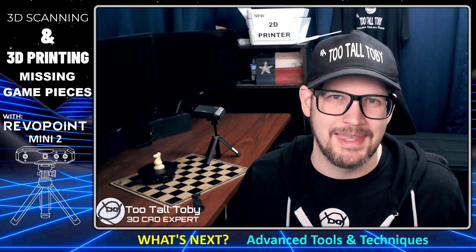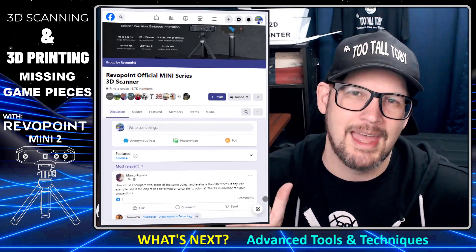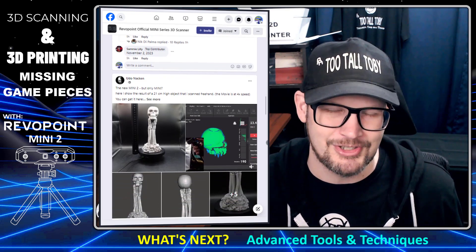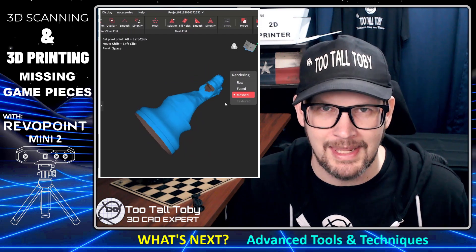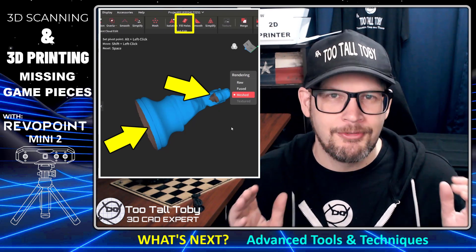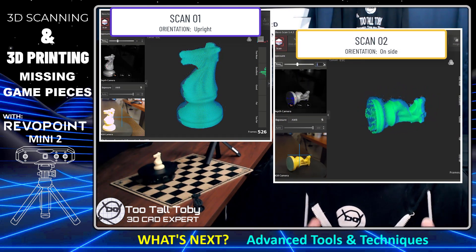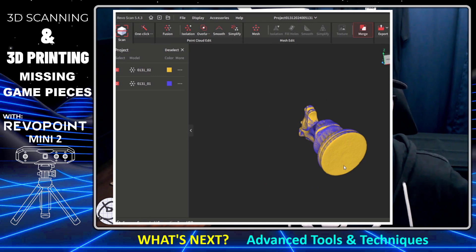This is really a testament to how easy it is to get started in the world of 3D scanning using Revopoint solutions, but this is just the beginning. Since making this first scan I've been regularly visiting the Revopoint Facebook group for Mini and Mini 2 users — I've included a link in the description. I've picked up a bunch of useful tips and tricks: for example, when we made the original scan I was missing a big chunk of point cloud data under the chin and base of the knight. What I've learned is that you can create multiple scans in different orientations and merge them together to close off those gaps.